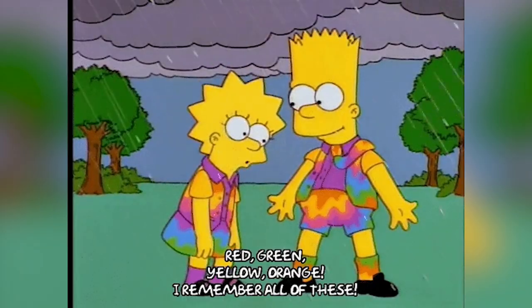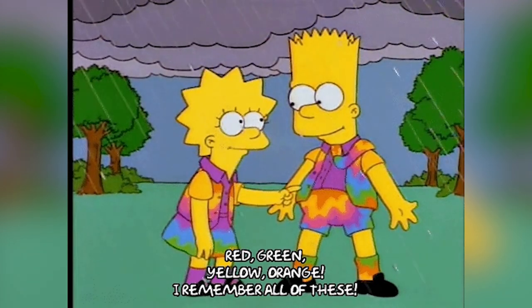The main difference is of course the grain and the base color of the wood that you're working with. Some types of wood are darker, some are lighter, but some types of wood are absolutely inconsistent in color. And this is exactly what we had in this case — we were supposed to stain and clear coat this entire staircase on both sides, which was very inconsistent. There was a bunch of pieces that were green, some were really red, some were yellow.